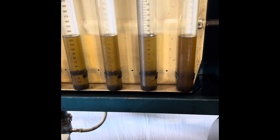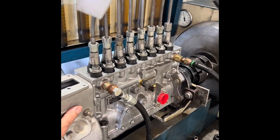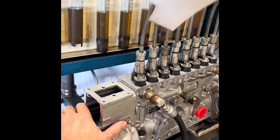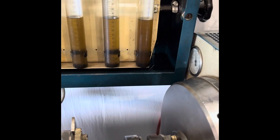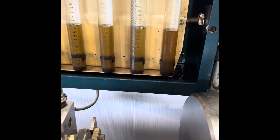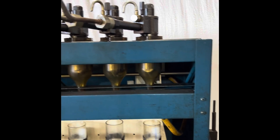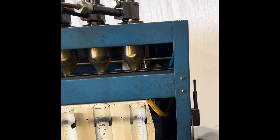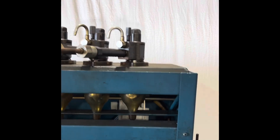The numbers can go a little more, but I've done a 14mm P8600 of my own and that was 1,300. So the math pretty much says 1,300 is going to be the result whether it's a 14mm P7100 or a 14mm P8600 — the math is the same. Basically the volume of fuel is going to be based on the height of the helix. Anyway, these are nice big T-size injectors. We'll go ahead and do all our balance and phasing work with these in, because they have the little drains for the phasing process.